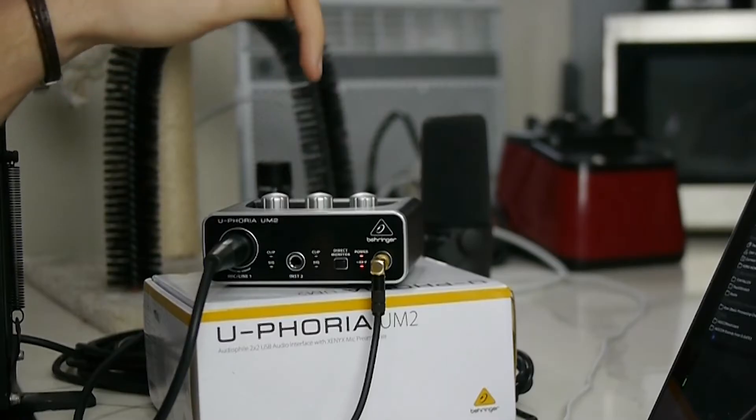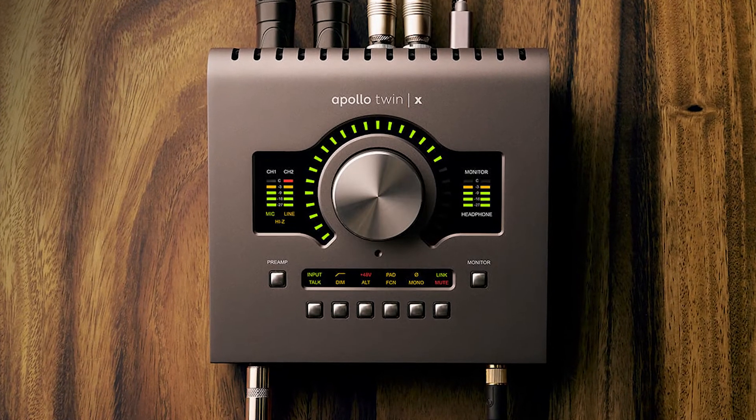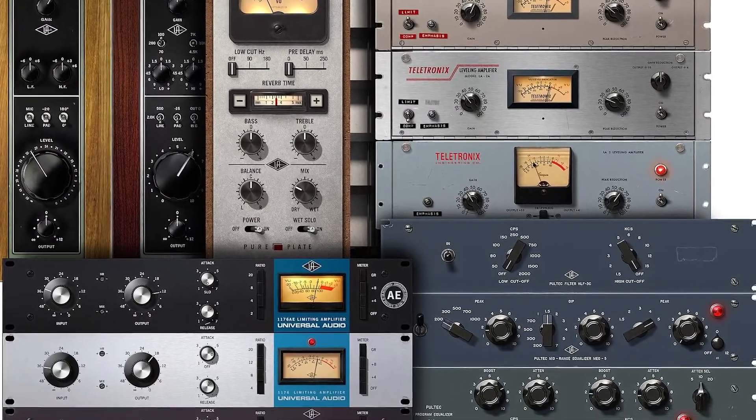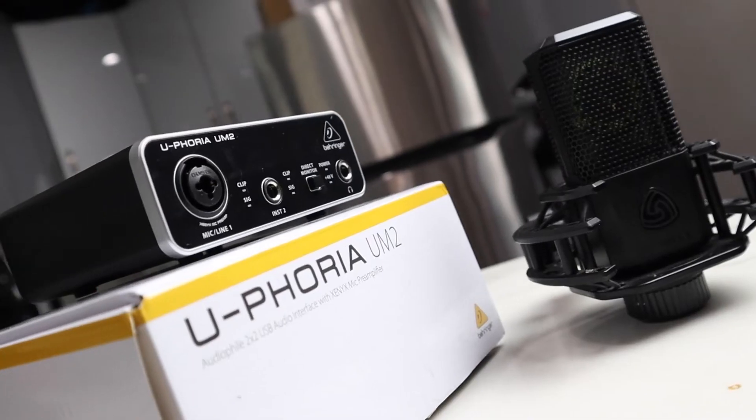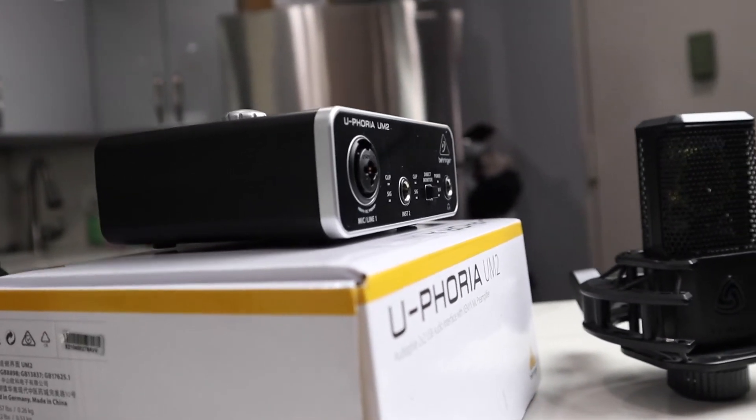Tubes do color your sound — they add a richer low-end and mid-range response, often described as a little bit sweeter. Those preamps are coloring your signal. Modern interfaces, on the other hand, are not coloring your signal; they're trying their best to remain transparent. Unless it's something like a Universal Audio Apollo Twin, which has emulations of old tube preamps built on board, most interfaces are really just trying to bring your microphone up to a proper level as efficiently and as quietly as possible.